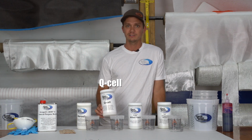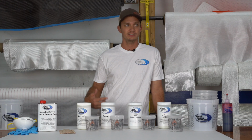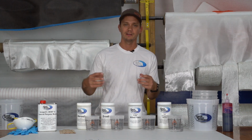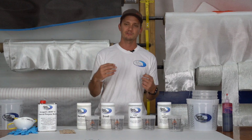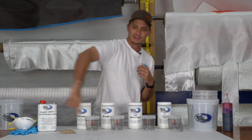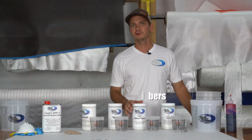Q-Cell is a popular brand of microspheres that we carry. It's very common in the marine industry. You mix it with polyester or epoxy resins, and it makes a nice fairing mud. It's not something that you'd layer up real thick or fill a big hole with, but it's something you'd use to make the surface fair. So you throw a big glob down on the boat and spread it out relatively thin, less than 1/4 of an inch is ideal.